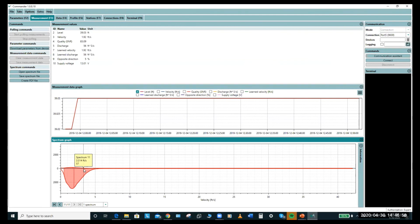Even when water is flowing, looks fairly uniform and it's raging down, we will still see flow in opposite directions, swirling. The radar knows by a setting there, if we tell it that we're measuring and it's only flowing downstream, then it can ignore anything opposite. You can see there's a little bit of backflow, opposite direction content here, but it will ignore that. And then this line that it creates in the middle here produces our velocity. And we have a quality value that comes with every one of these. It is on the output string.